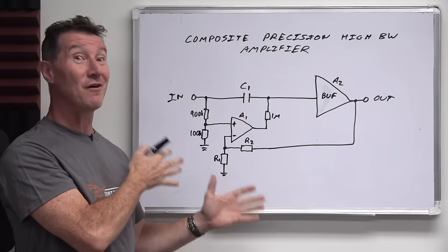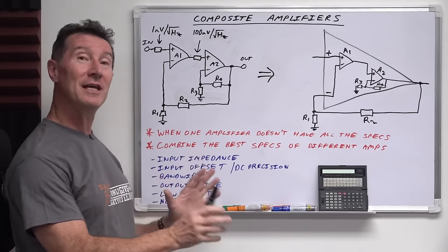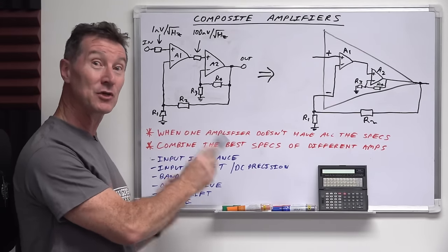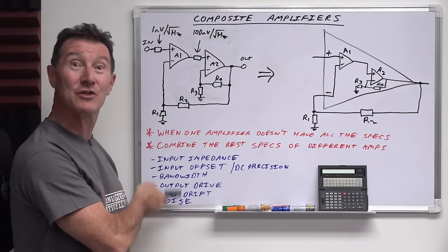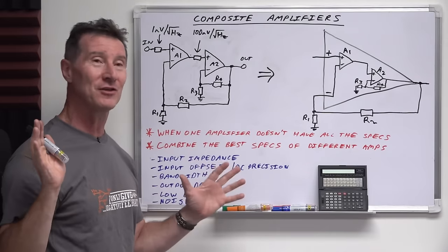You've got R1 and R2 to set your total composite amplifier gain here, because it's feeding back from the output instead of from A1's output. So it's a composite amplifier with the best of really high frequency AC, high bandwidth, high drive capability combined with DC precision. You might have to add some compensation stuff in here to make sure everything's hunky dory. But it combines the best of both worlds. Composite amplifiers — brilliant. Hopefully you're getting the idea that composite amplifiers are a very powerful technique when you just can't find that perfect op amp.